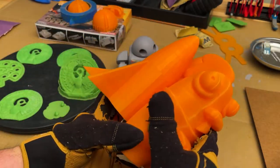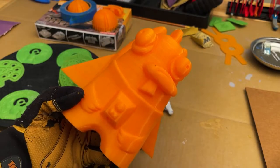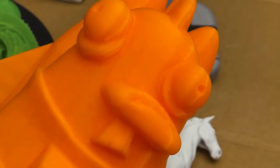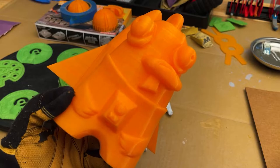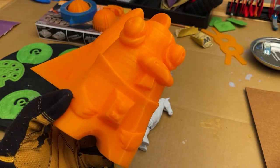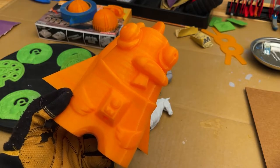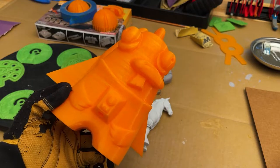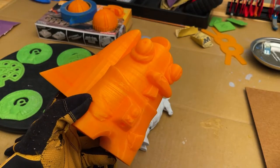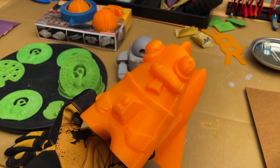If you look at the quality of the print — this is a filament that came from FlashForge — you can see it's pretty solid. It's got some kind of boogie there, but it's very smooth. This is PLA filament. Generally I print at 215 degrees for the nozzle temperature and 45, 55, or 65 degrees print bed temperature depending on how hot it is in the garage, because sometimes I do have trouble with print adherence. I often put a raft under my prints because that seems to be easy to spot if the print is having trouble grabbing onto the print bed. But I think once I cover this with some primer, it'll be nice and smooth and ready to go.